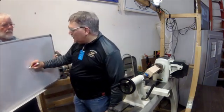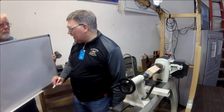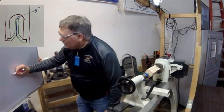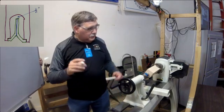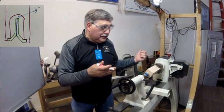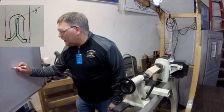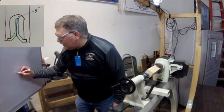So what makes this work, we're going to have our salt shaker here. It doesn't look anything like that because I can't draw. Okay? And we're going to bore a hole in here. Now, I don't usually use the F word when I do demonstrations, but I must say it, Forstner bit. I'm going to use a Forstner bit. And then we're going to dome this area up here. Then we're going to come back and put an insert in here.